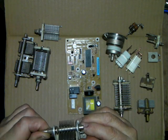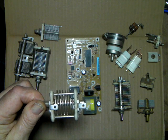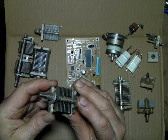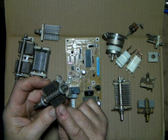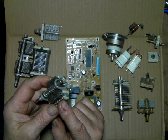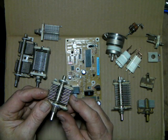This one would work. It's a little small. This is a 20 — I think it measures 24 picofarad. It has the threaded connector shank on it; you just put a ring nut on it in one hole and it mounts to the front panel. This would work, but we have to pull a trick with it by padding it with another ceramic capacitor to bring it up to around 35 to 40 picofarad, depending on the tune circuit you end up with. We could make that work if you couldn't find anything. The shaft type controls are getting really hard to find.